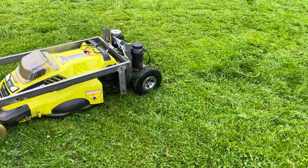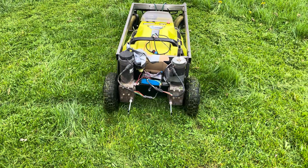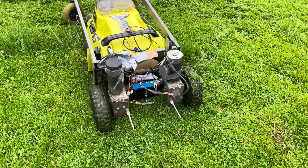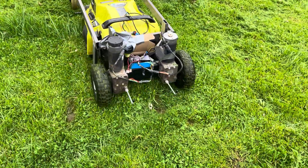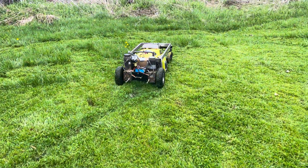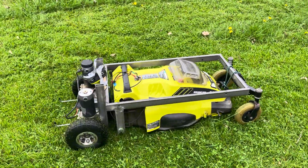Another thing I learned is that with tank steering, depending on how you're moving, you can have both wheels moving, moving in opposite directions, or just one moving. The issue is if you're steering with only one tire moving, you lose half your traction. Going forward is no problem, but with these two wheels being relatively close together on wet grass the steering isn't fantastic. As long as I'm moving forward it's fine - again, kind of worst conditions possible. I think tank treads would be pretty unstoppable.